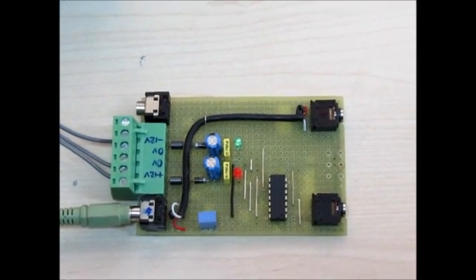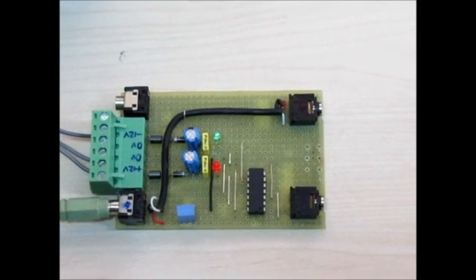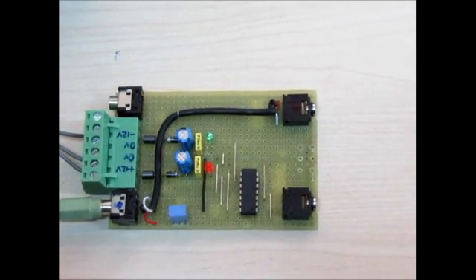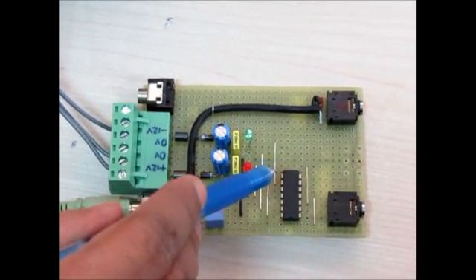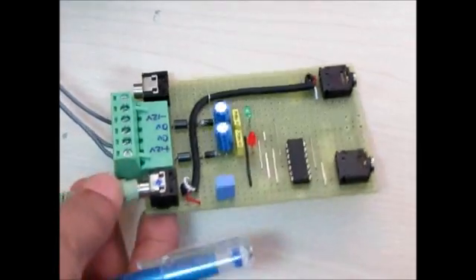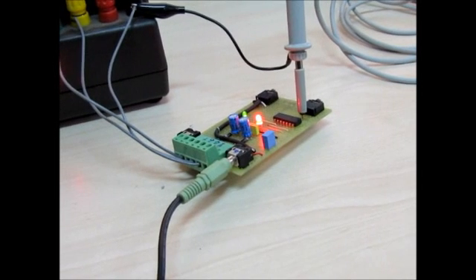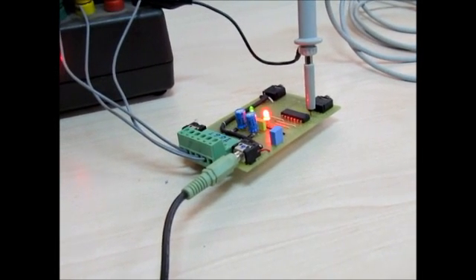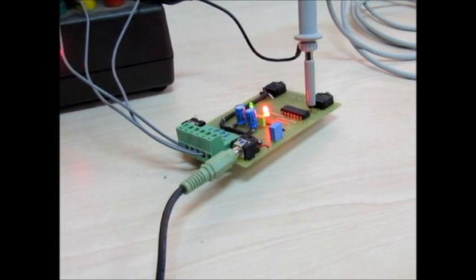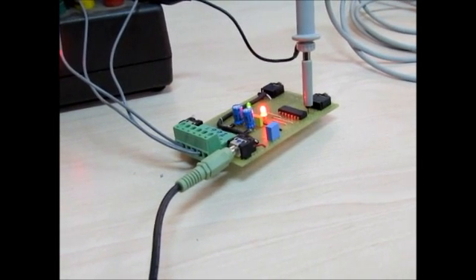Filtering in only the low-frequency sounds is important for realism as the vibrations consist mostly of these. At the heart of the tactile actuator driver board is Texas Instruments integrated circuit UAF 42, a state variable filter. It made it easy to design our active filter because we only needed to use 6 resistors, which you can see mounted on the board. Our active filter is a second-order filter with a minus 3 dB point at 120 Hz. The values of the components have been calculated using the Filter 42 program supplied by Texas Instruments. This filter helps achieve a very sharp rejection of higher frequencies, assuring that only low-frequency signals get transmitted without any risk of damage to the driver coils of the actuator.